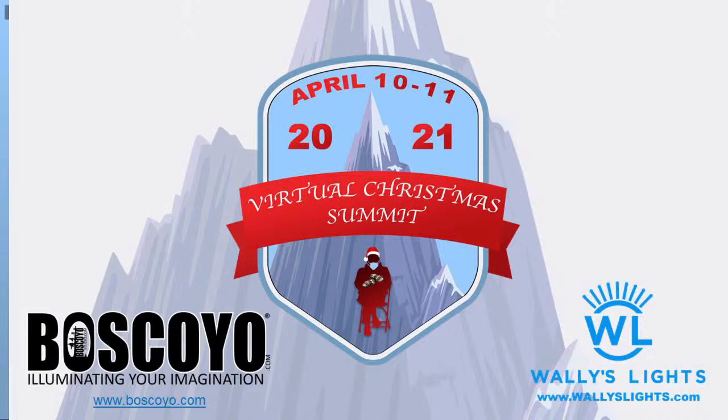So this is a little setup I did to show you how voltage drop works. You'll see the left side circuit is 5 volts, the right side circuit is 12 volts, and yet the voltage drop in both cases at the red LED is 2 volts. If you're eagle-eyed and noticed I changed the resistor, that is not the reason the voltage drop stayed the same. I just did that because you want to keep the current under 20 milliamps.